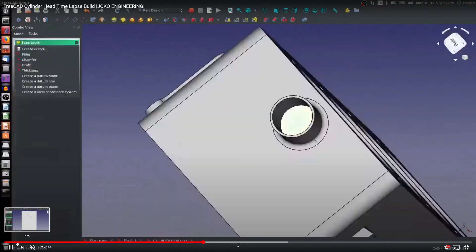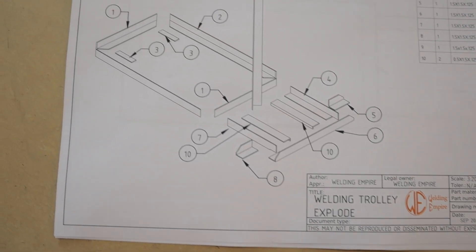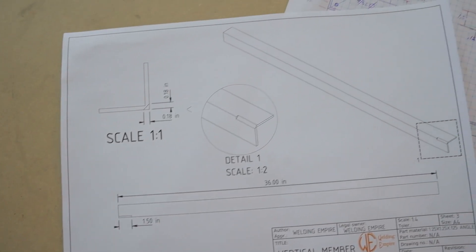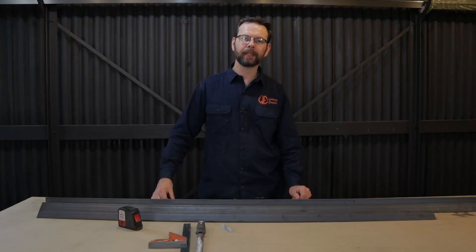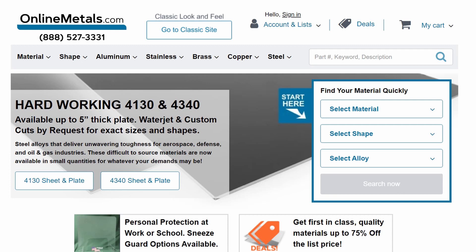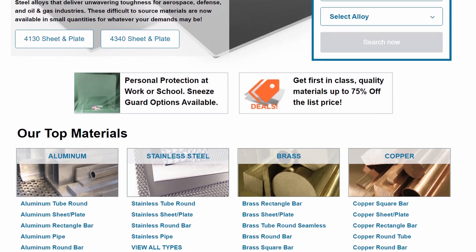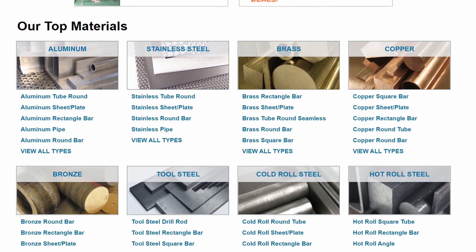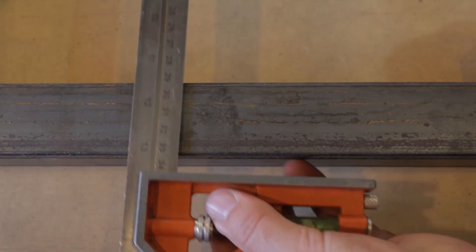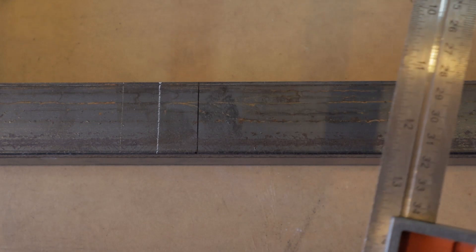You can check out the link in the description to buy a set of the plans. They are currently in inches, with an exploded view and individual drawings for each part to avoid confusion — these are workshop-quality fabrication plans. I've designed the cart base at an inch-and-a-half equal angle with an eighth-inch wall, or 40 by 40 by 3 millimeter. The longest length is 36 inches, so if you're using an online metal supplier, 36 inches gives you the best bang for your buck on postage with very little material wastage.